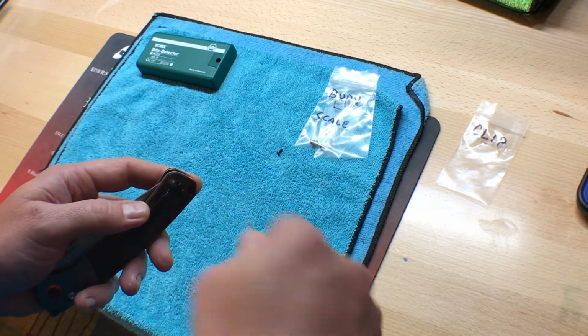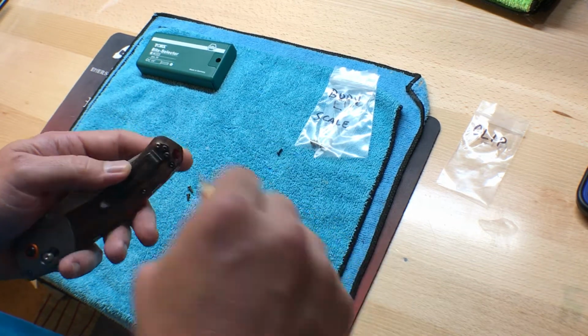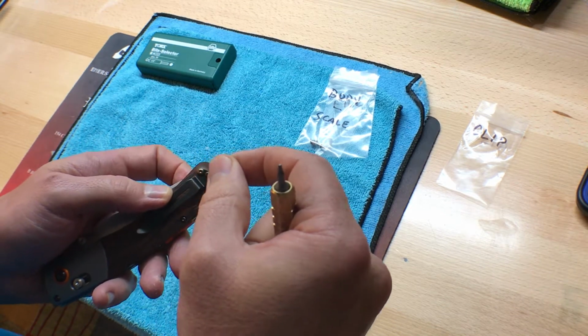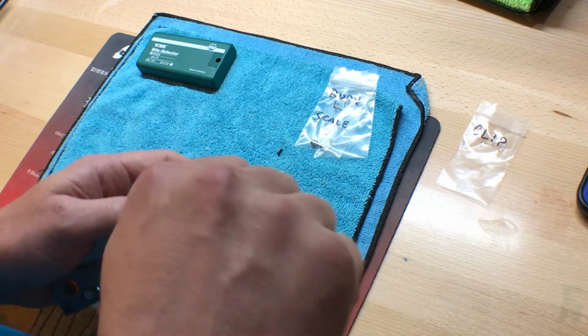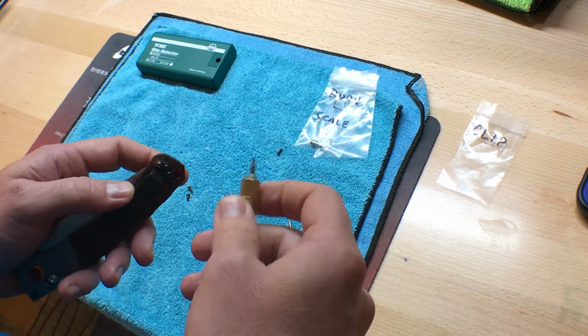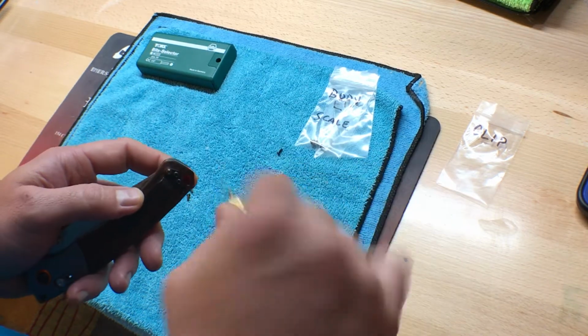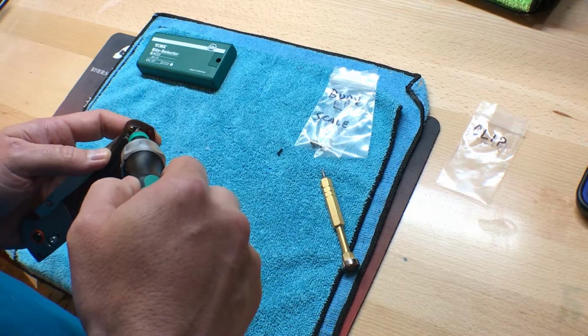Anything past that, this is not like a 1/4 inch wood screw that you're driving in with a big screwdriver. These are little 2-56, 2mm wide screws that you could strip the heads out of, or you can break the stems on them if you crank too hard. That's not a very common thing, but it's just better to do something with a little feel so you can avoid that. So let me do these other two.